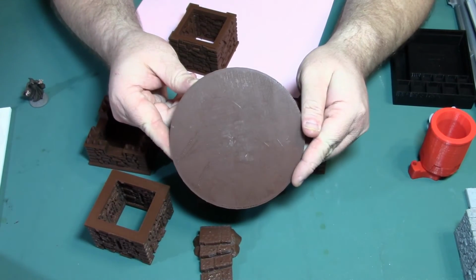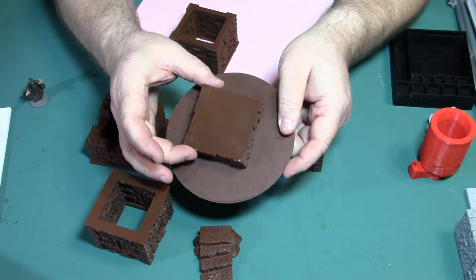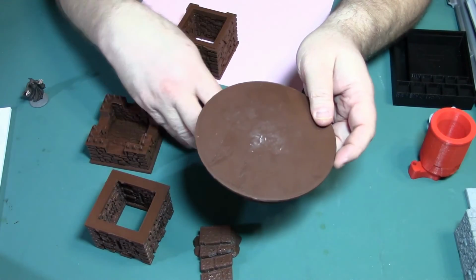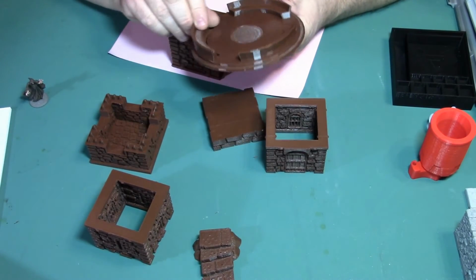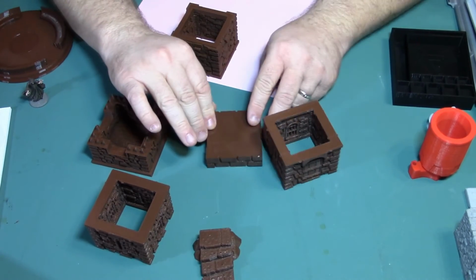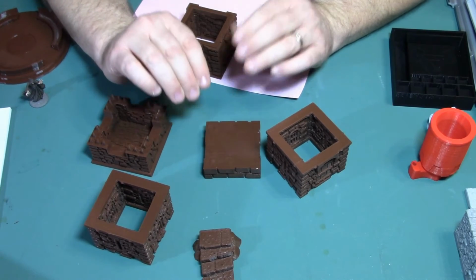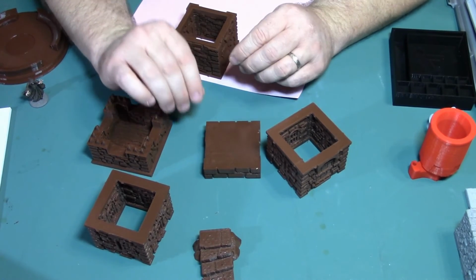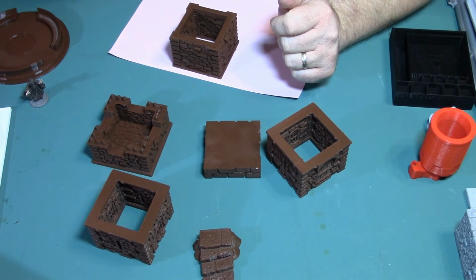Look at the bottom of this print. It's matte, it's flat, it's fine. Then look at the bottom of this print that came off the bed. I was using build tack when I was printing some stuff before, and when they say stuff sticks to build tack, they are not lying. It sticks crazy good. The problem is it sticks so well, I wrecked 3 sheets of it in 2.5 months I've had the printer now.